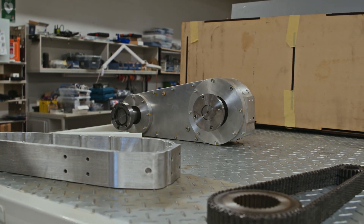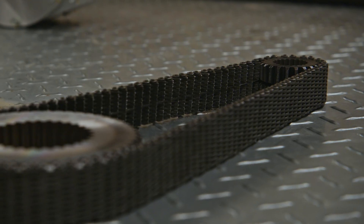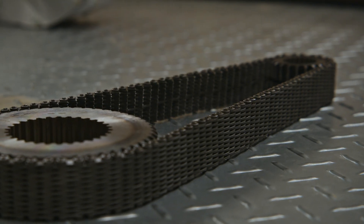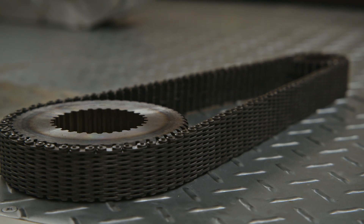When you study the designs of automotive transfer cases, what you don't see is any kind of chain tensioning device. A chain tensioner is fine if the chains are only ever going to run in one direction, because you can put a tensioner on the slack side of the chain. But if you've got a reversing drive like we have in an automotive scenario, you never see chain tensioners.